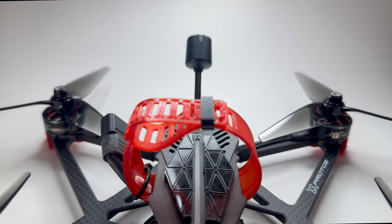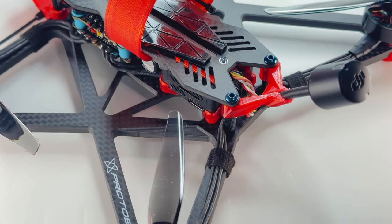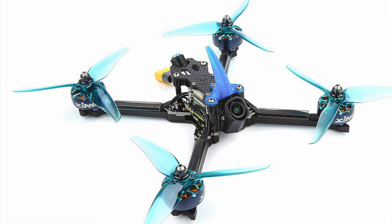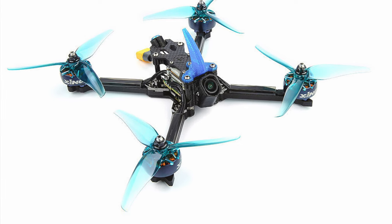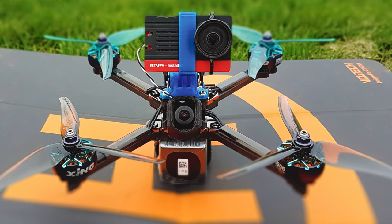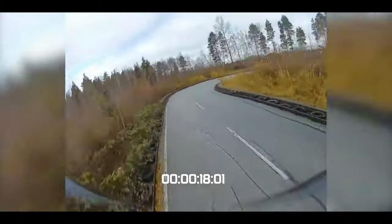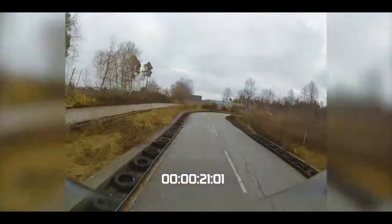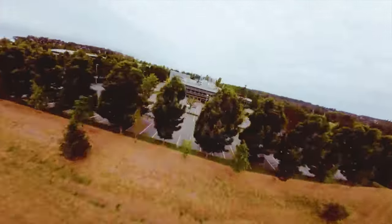So what is a cinematic racer? P5 was inspired by my entire FPV journey — it's got a little bit of DNA from each of my favorite quads. First up, the iFlight Mach R5. I really enjoyed how overpowered it was at 335 grams with motors that belonged on a 6 inch. I wanted to share what I was experiencing, so I replaced the shark fin TPU and put an action camera mount on it, just to record the 4K footage and sound — 225 kilometers per hour full throttle runs. Though the quad had some downsides: it is a race frame, so there's not much space. Through the goggles, the quad had huge props in view, and when I flew it I would totally run out of room very quickly.